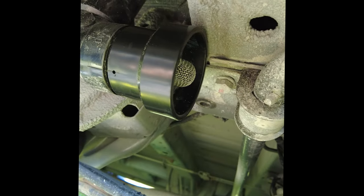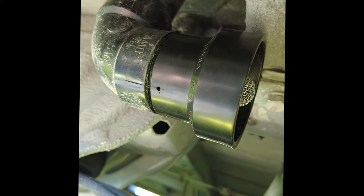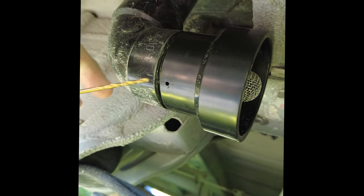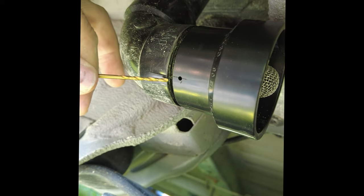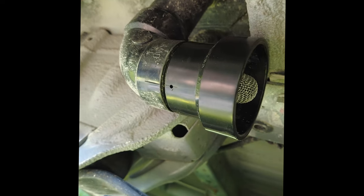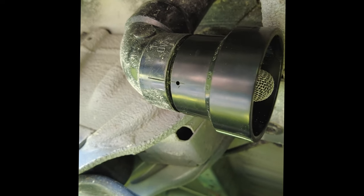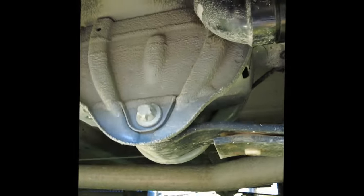Just about done. I've sanded this all down nice and smooth so I can get that flange on there as far as I can. Right here I drilled a pilot hole, and I also scored both pieces because if in the future I have to take this off, I won't have to look for where the hole is — it's all on the same line. I've indexed the hole, so now it's just a matter of putting the screw in to finish up this little project.